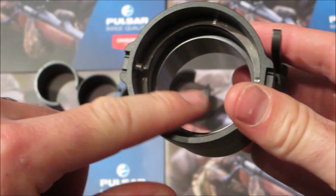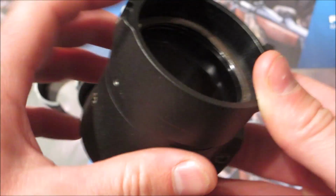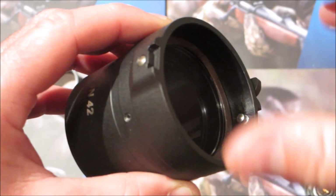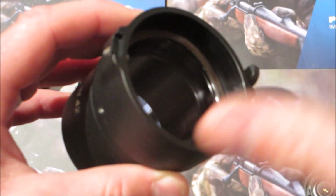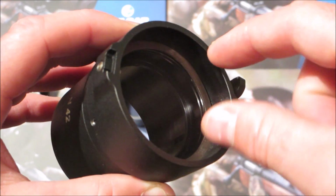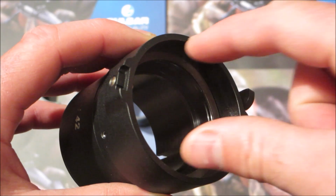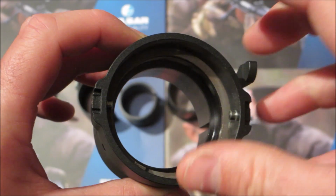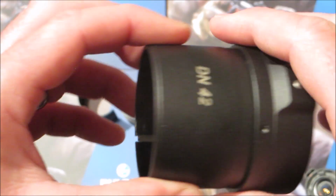So this side the FXQ attaches, there is a spring. It's kind of a spring washer. It's got a little wave to it. So you have to push that in there. Whenever you cam it over, it puts tension on there, and that keeps the FXQ from rattling around. Besides that spring tension, it is a really close fit, so there's really not any play, and these cam pins cam in with the other adapter.